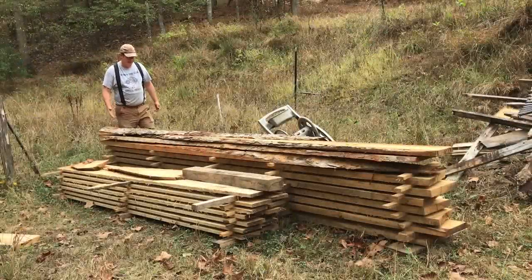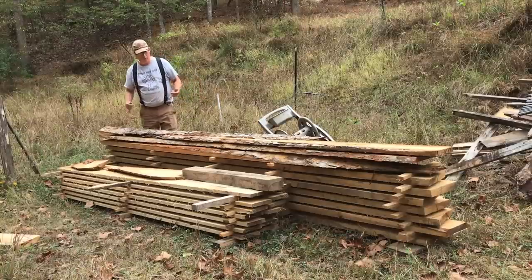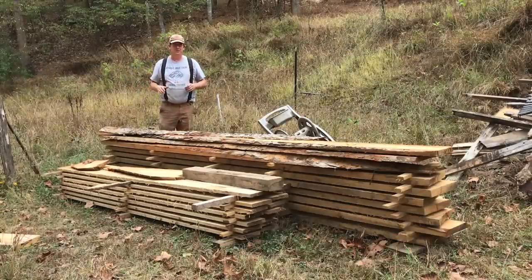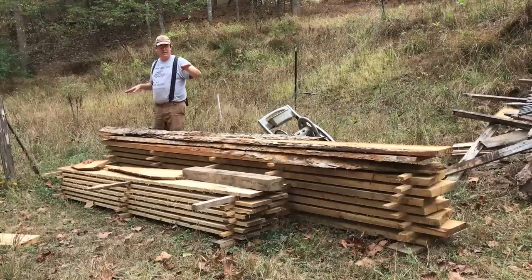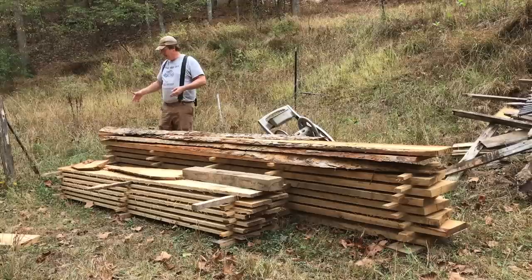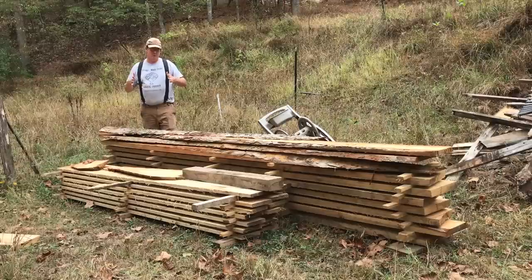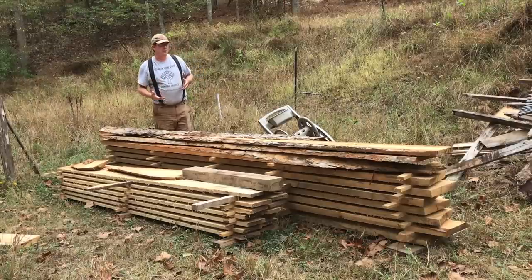What are the options for drying? As you can see, these boards are stacked outside with ricks, stickers — whatever you want to call them — the boards that go sideways and lift the boards off one another, allowing them to dry more evenly. Wood is basically made up of a series of straws running lengthwise, so water wants to escape the ends faster than the middle, which is why you get checking. Ideally you'd seal and coat the ends of the boards to slow that moisture escape and let it evaporate more evenly through the cell walls.